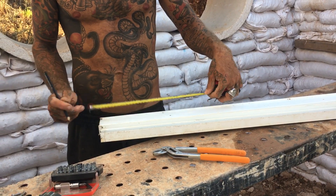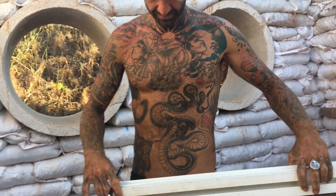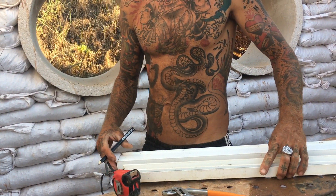We were quite bold this time — we made those box frames with really centimeters to spare, which we thought we were experienced enough to get away with. But as you can see there, after we installed the frame, although it fit, there was just a little bit of deviation between the width at the top and the bottom of the door, so when we put the doors into the door frames there was just that gap at the bottom, which of course is not going to work.